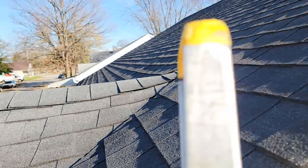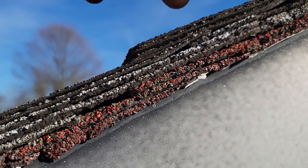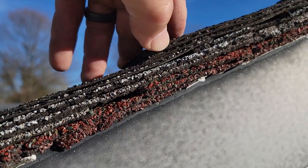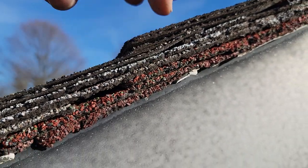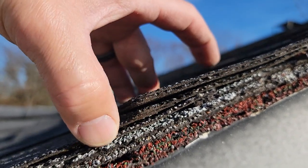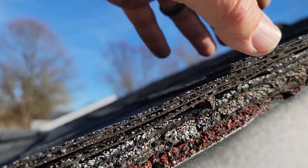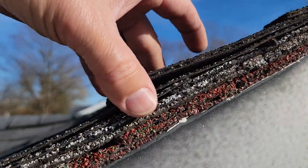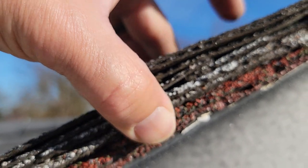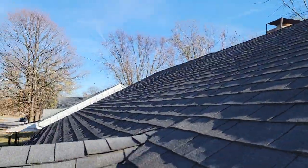The garage roof is done. The house roof has been touched but wasn't replaced. Let's start off right here at the gable edge. Look at that — that's a thick roof. Some people don't know what I'm talking about: the starter doesn't count as a row. When you have shingles like this, this is not a starter. Here's the visible side, here's the common bond where my thumb is underneath, and there's the headlap toe. This is one layer. You can also see the color difference — there's a white layer, that's number two, and a red layer down there. So three layers. This is a nasty mess.